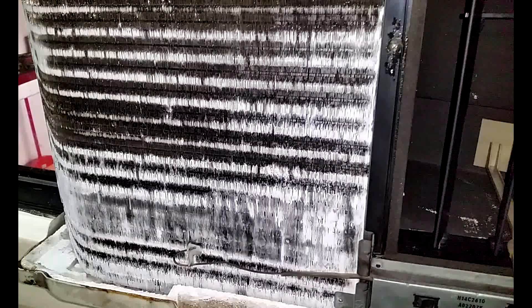If you are having a problem like this, first check your air conditioner's air filter, because if it is dirty that can cause this problem. After that, check the evaporator coil — if there is dirt in the evaporator coil that will also make ice build up, so you need to clean your evaporator coil carefully with high-pressure water.